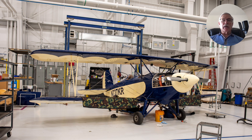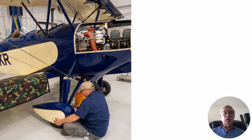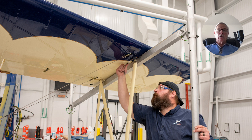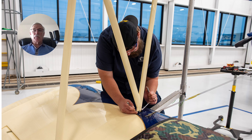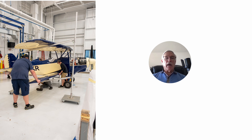There's quite a bit involved in doing this. I figured they'd just pop that little center section out and fix the ribs — well, it's not quite that easy. There's a lot of disassembly required. They get the aircraft in a jig, prop up the wings, and start removing all the flying wires and landing wires. Then they remove the struts. And now they're removing the wings one by one — four wings. That's the added safety factor: not just two wings like on some aircraft, I've got four wings.